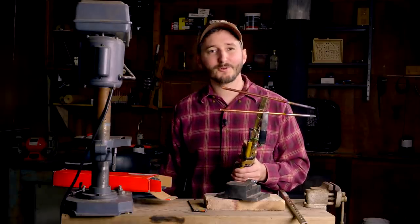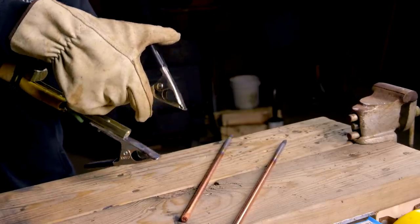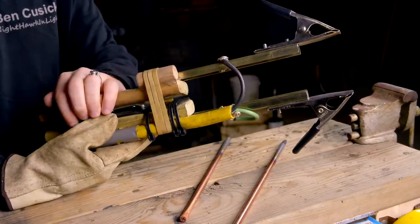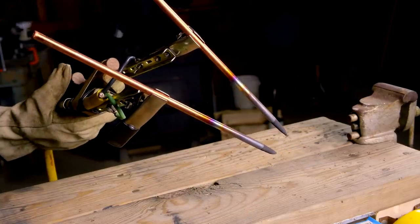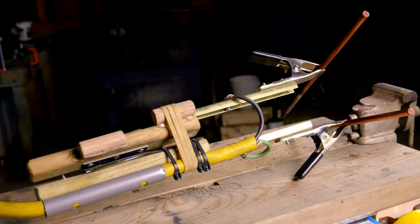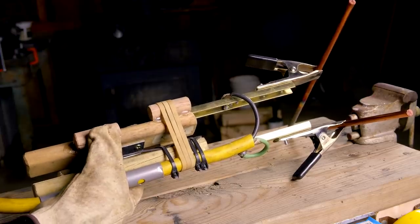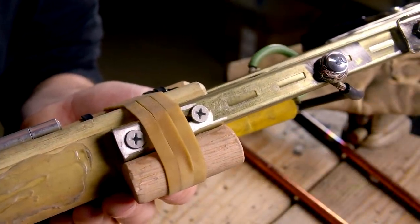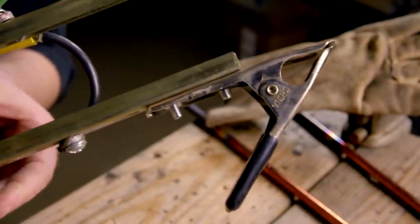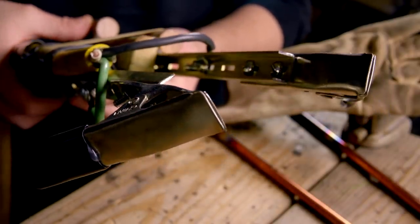I don't think I'll ever have to buy carbon rods again. These rods are mounted in metal clamps, which are on an articulated handle so that I can bring the two rods together and strike an arc between them. The handle itself is made of wood so that the two articulated pieces are electrically insulated from one another. To each section of the wood handle, I've attached a metal rail to extend the end of the torch further away from your hands, and at the end of each rail, a clamp to hold the carbon electrodes.